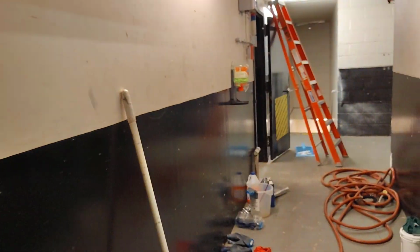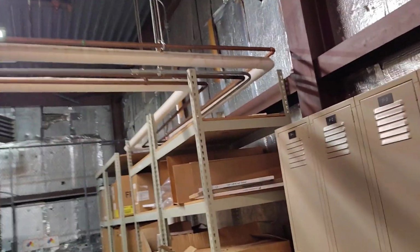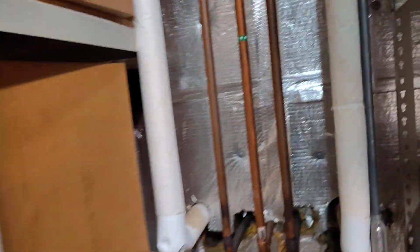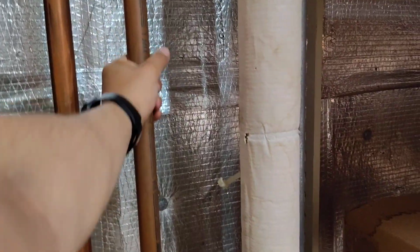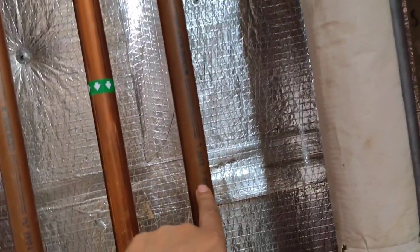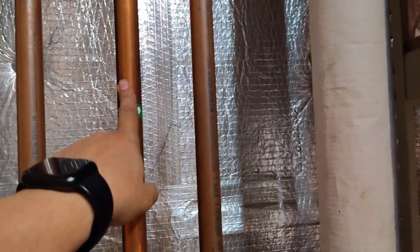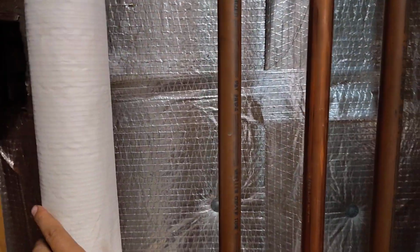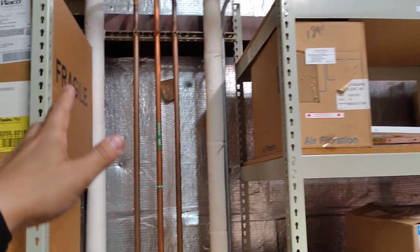This is our chiller that is served by air cooled. As we see here, let's go to this side. We will see here the 2 pipes for the hot water, and this is pipe type L, and this is the vent pipe that I showed to you, high pressure vent pipe. And this insulated one is the pipes that are carrying chilled water. This means the supply pipes.